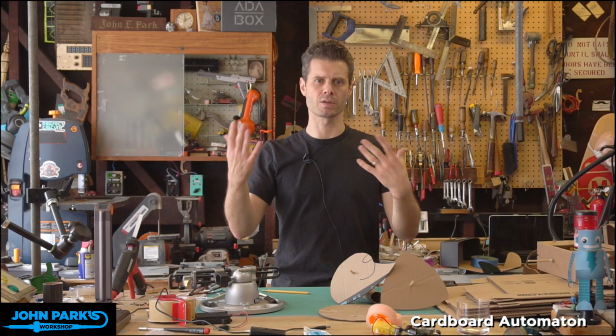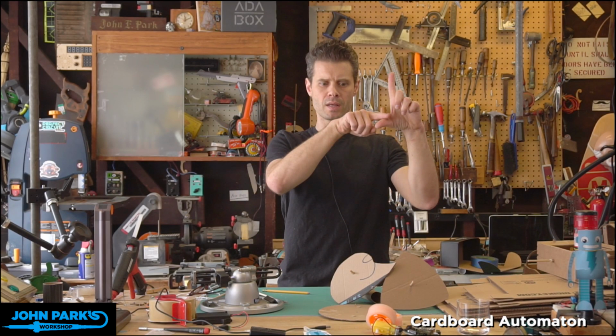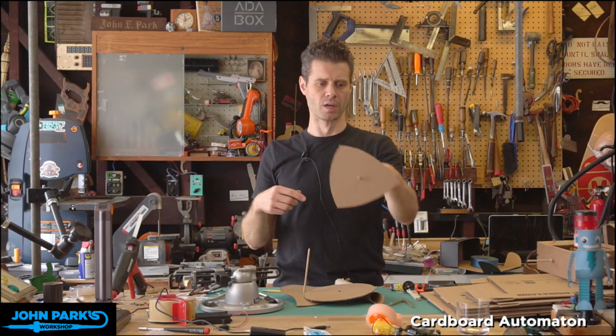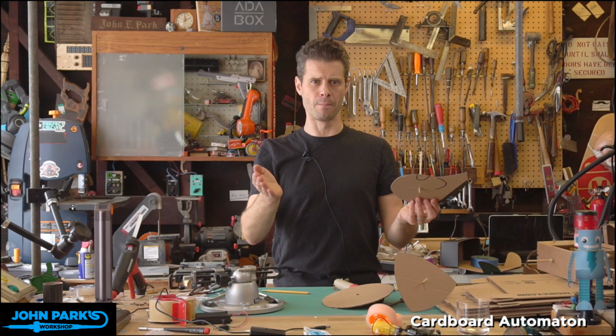But if you consider a curve of up and down, which is Y, over time, you get different types of motion. If we use this circle, we get a nice sine wave type of shape. If we use our triangle, we'll get sudden peaks and drops, like a sawtooth almost. Our nautilus will have an ease up and then a sharp drop down, actually I should say this is like a triangle, and this is like a sawtooth with a sudden drop.